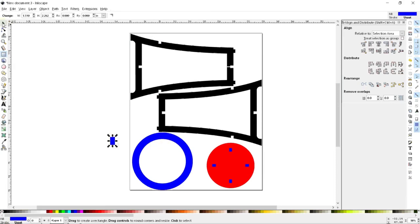So just like before, I'm going to make a tab that is the thickness of the material. And we'll go ahead and make this, say, something easy like 2 inches tall. And now I need to snap these over each other. And I now want to make sure that I am going to be cutting away exactly 13.214 inches. Since these are 2 inches wide, I can subtract 2 inches off of that and simply now shift this by 11.214.